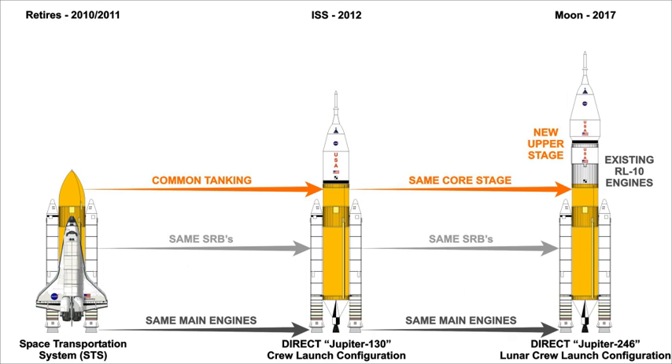One of the primary goals of the DIRECT proposal is to develop a new heavy-lift rocket in a shorter time frame. When the DIRECT project began in 2006, the Space Shuttle was expected to be operational for another four years or so. DIRECT had always planned to use the four-segment Solid Rocket Booster unchanged from the Shuttle and to make use of work already underway for the Constellation project on the RS-68 main engine and J-2X upper stage engine. By 2009, however, there were concerns that the ablatively cooled RS-68 engine could not survive the intense heat from the nearby SRBs. With this worry and with Shuttle retirement imminent, the DIRECT V3.0 proposal called for using the more expensive regeneratively cooled, reusable Space Shuttle main engine in a disposable role.